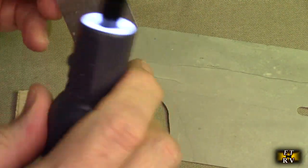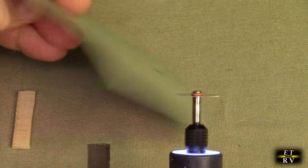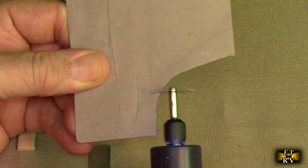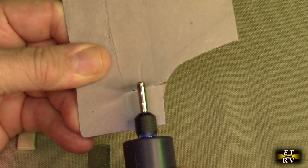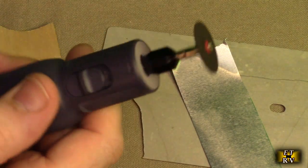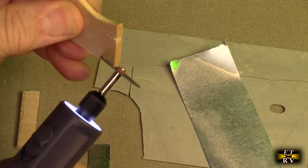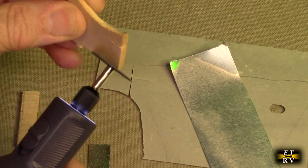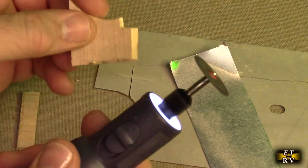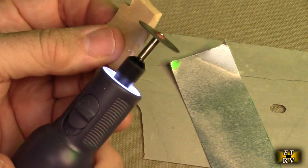Here's a piece of aluminum. This is the typical fiber material that I use on counters — this is a sample. Now I have a grinding attachment on there, which is for precision grinding or cutting as well. It's nice for doing little beveled edges. You have full speed control, and if you drop it down to the lowest speed you still have a lot of torque.